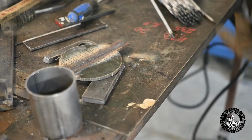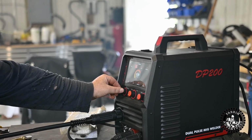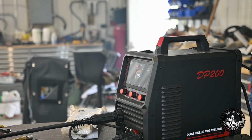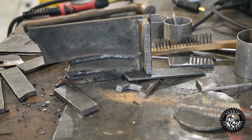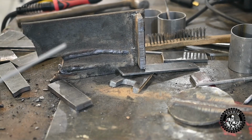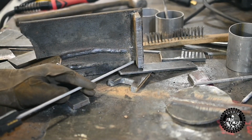Huh, that's cool. We should try a little 6010. And turn that down. Yeah. Side of 120 amps, going up, and it's going to be 1/8 inch rod, on our plate of 3/8 and 1/2 inch. There's already a 5/32 point weld in there. Let's see how she does uphill here.